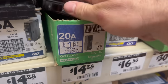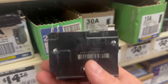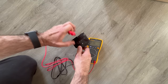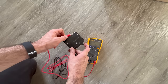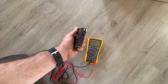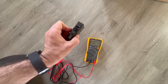Right here at Home Depot, that's what we need. Here's our new breaker — it's in the on position. One lead to the lug nut and the other, and then if we switch this it kills the connection. So that's how you test a breaker. Let's throw this in. When replacing a breaker, make sure that the backs match up — there are a couple of different types and it does matter which type you get.